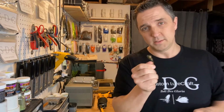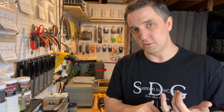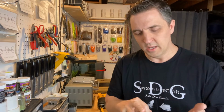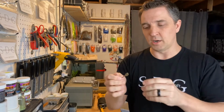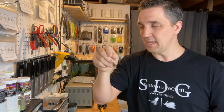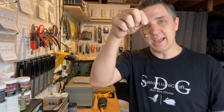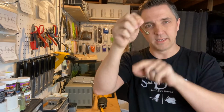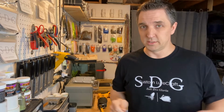So that's one. Two, certain powder paints are notorious for this. I'm thinking of anything with pearl, so pearl white or pearl whatever, and especially just white in general. For whatever reason, those colors are heavier, and in my experience, if I hang them, even if I powder paint or fluid bed paint them, oftentimes I'll get a droop at the bottom. And like I said, it basically ruins the jig.